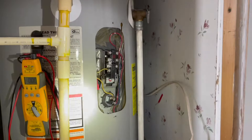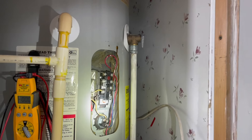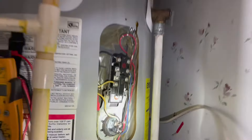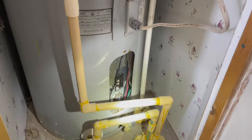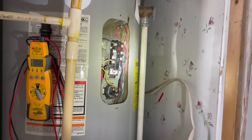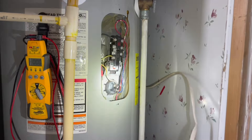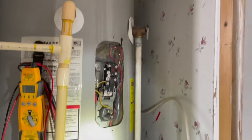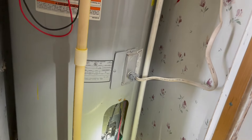So I took the panels off. Both thermostats are set for about 140 degrees. Neither are running. I don't have power to either of my elements. So I'm gonna shut the power off and check the elements as well. Right now it looks like at least what we probably need is two new thermostats - lower and upper.